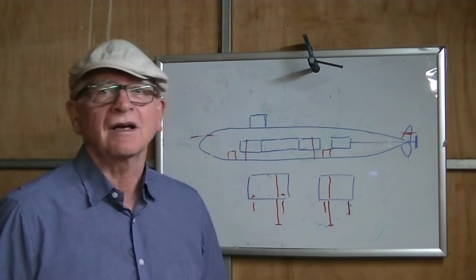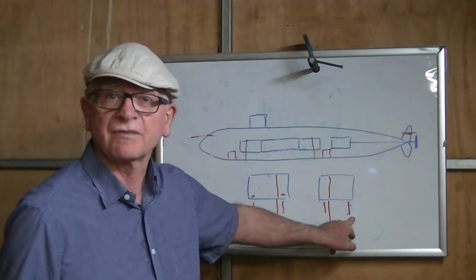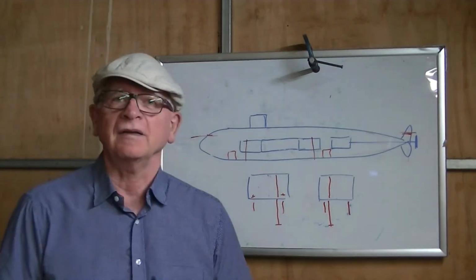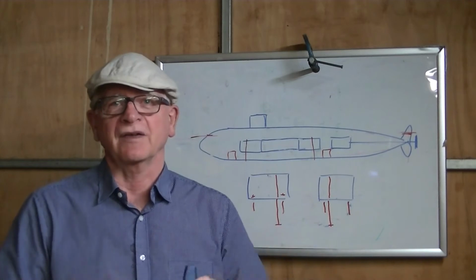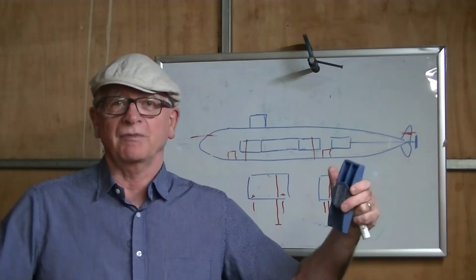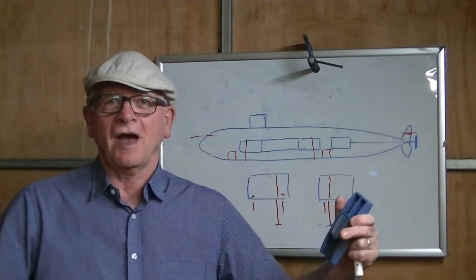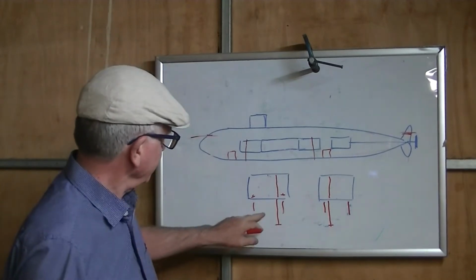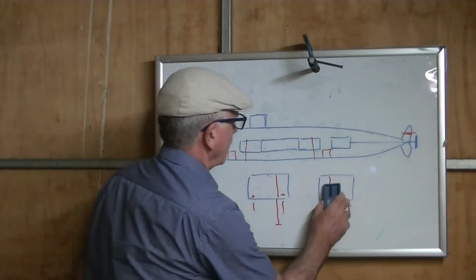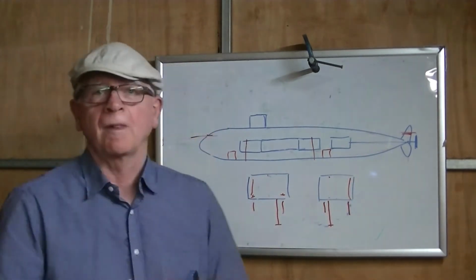When I'd achieved that, I took the boat out of the water once again, and this time I brought the pistons out to the maximum positions, and I actually opened the watertight cylinder to do that because I didn't want any pressure to get involved in that. I should say, by the way, I discovered that to pull the watertight cylinders apart and put them together, I didn't realise what a big difference having twin pistons made, because if you disconnect all of the connectors and stuff, and you put the watertight cylinder on the bench and bring the pistons in, it just pops apart. It's really quite easy. But put this in the water, got that, then I put them at maximum, in that position, put it in the water and it floated.